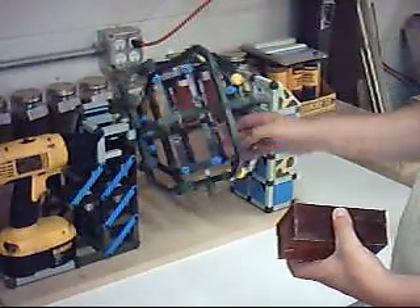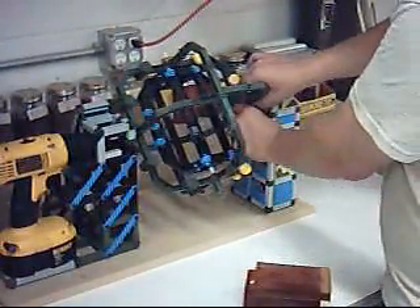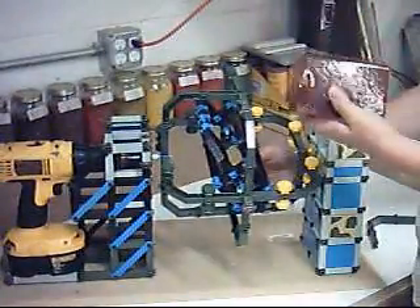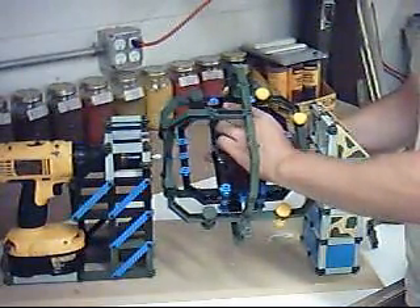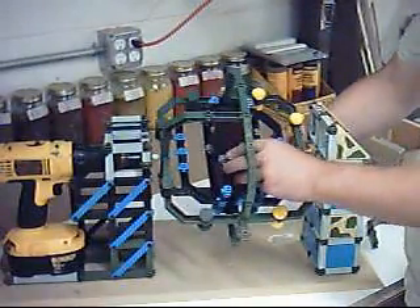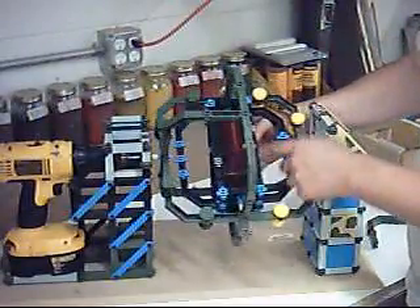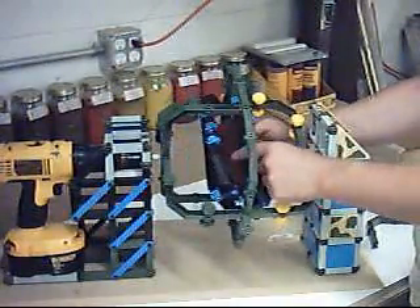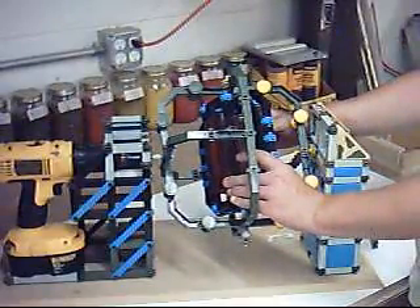So, the basics: take your mold — you need to make sure when you're casting your box that it fits into your plug in here. Slip your mold into place here and secure it with something; I normally use rubber bands. For the video, I'm just going to slide it into place to give you an idea of how it works. I've also marked where the center of gravity is on my inner piece here, so that as this rotates, it will be centered and even.